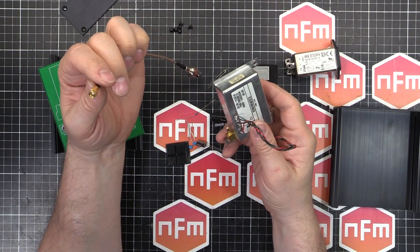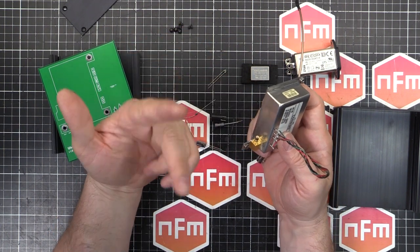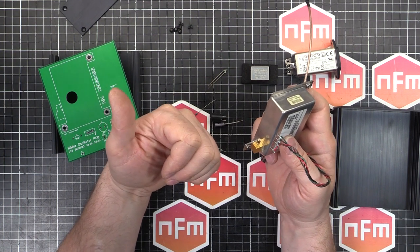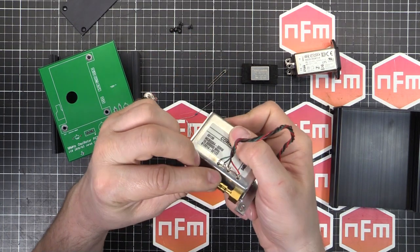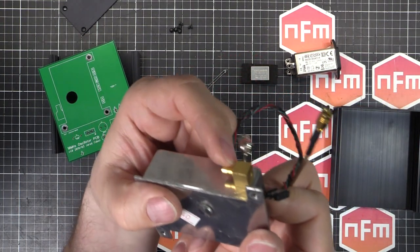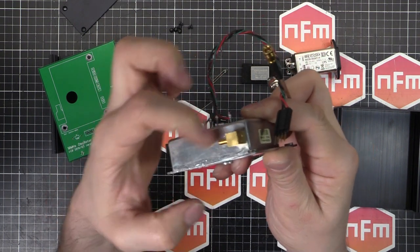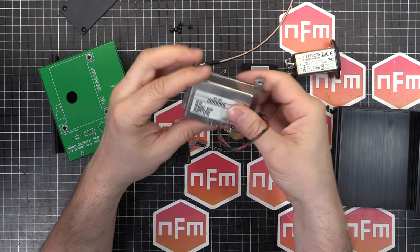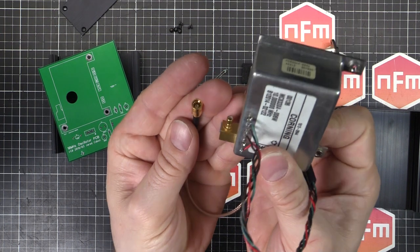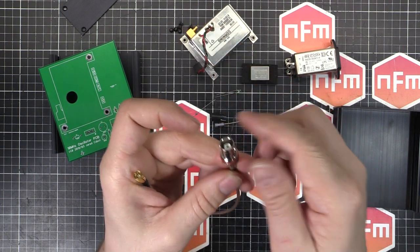It's related to the SMA and also SMC. There are kind of three types that are very common: SMA, SMB, and SMC. You'll all probably know the SMA - it's the same connector as what's used on the antennas for your Wi-Fi. SMB is a push-on style; it doesn't need to be screwed on. And SMC is kind of a hybrid of the two, where it's got a little snout bit and then it's screw-on at the back, but not all screw-on like an SMA. So it's just different variants. This one is an SMB - just a push-on style.